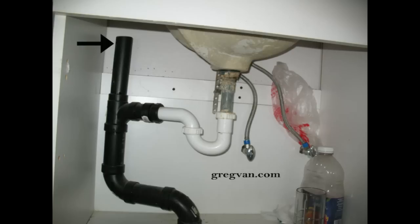Like I said earlier, this vent supposedly should be going out of the roof — the top of the roof. You see them, the little pipes sticking out of the roof on practically every home. These are the vent pipes, and once they get out of the home and are located in the right spot, you're never going to smell any of these gases. It's going to vent out into the atmosphere and shouldn't be a problem.